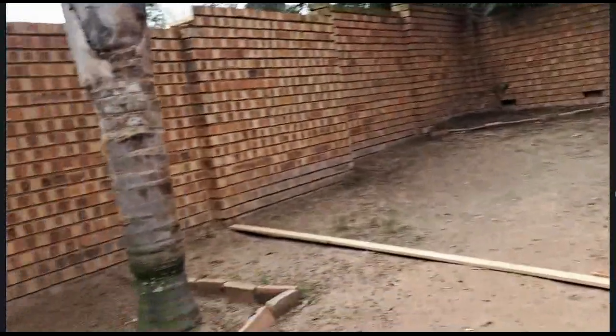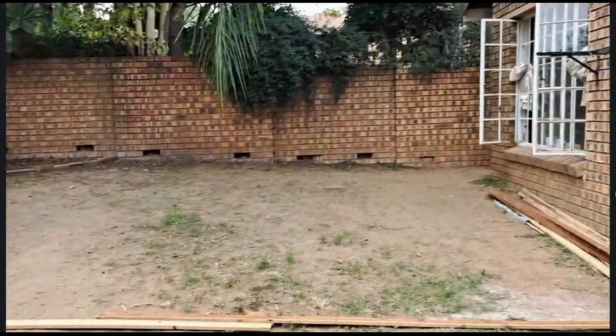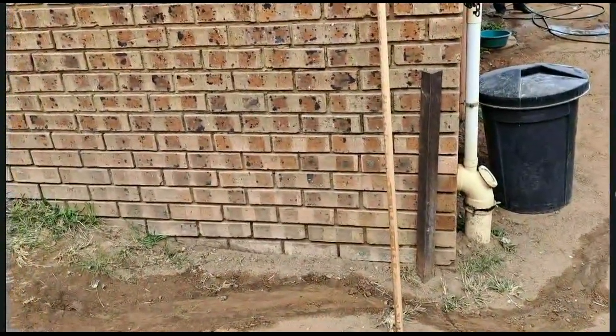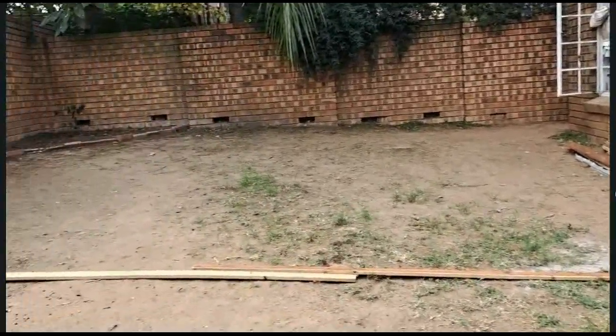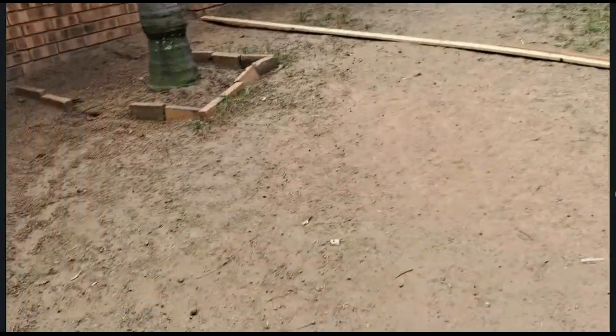We could not remove the soil to level the area because everything underneath the ground is just boulders, stones, and rocks. It would take specialized equipment, and to bring in extra soil to level this area would take tons and tons of ground. I would have had to lift it eight bricks high from the front corner just to get it level. So the best option was to build the area in steps.